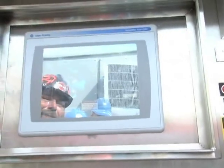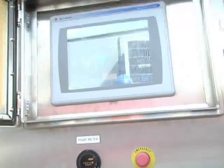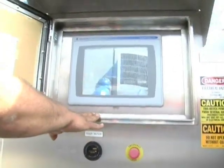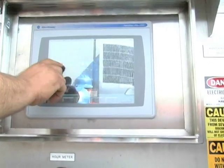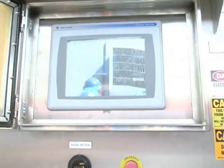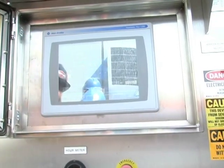You guys don't have a minimum air temperature setting, so you're not going to shut down in the winter. 120 degrees — that's going to be your incoming air alarm. The only thing that'll really cause a temperature issue there is if the air recirculates inside and it doesn't pull enough air through to cool itself. Here's your oil system: the actual 61 degrees. At 60 we have a low alarm, at 50 we have a trip — at 60 it's going to cycle the oil pump on to warm up the oil, and at 50 it's not going to let you start. High temperature is 150 for the alarm and 160 for the trip.